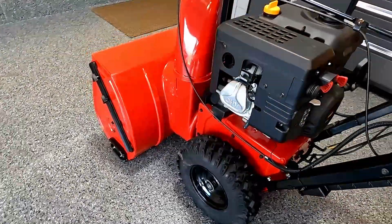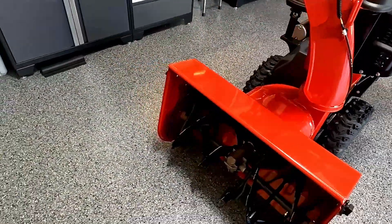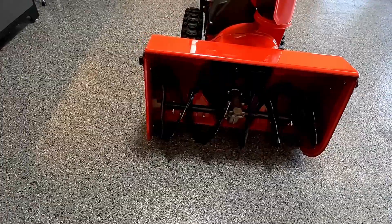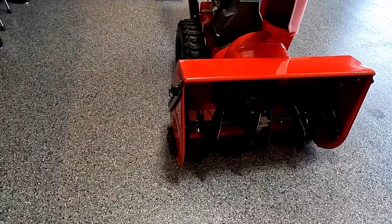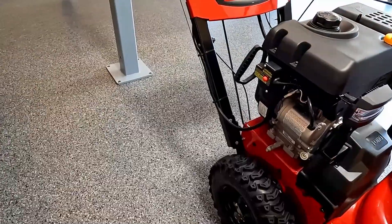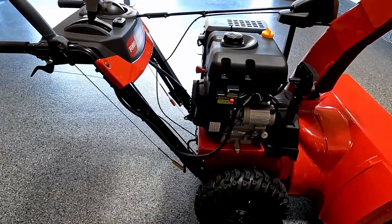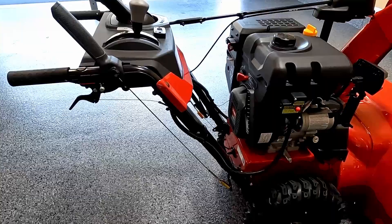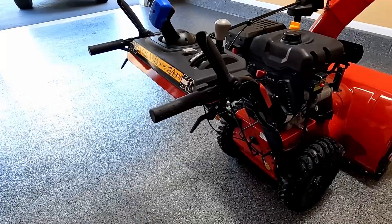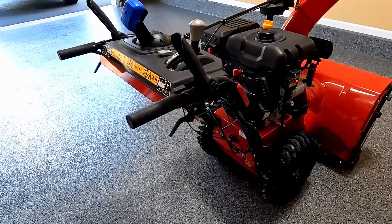I'll also pump up the tires. Your tires are naturally porous and will seep air, so even if you pump them up now, they might still need a little air when you take it out of storage. You especially want to check the auger and the impeller — there's a possibility you could have hit something and bent them without noticing. One nice thing about Toro machines is they don't need shear pins. Toro hardens the systems on their machines, so you don't have to worry about breaking one mid-storm. Toro also has no grease points — the bearings are all sealed, so that's one less maintenance item.